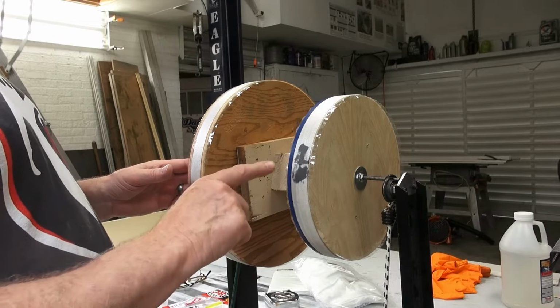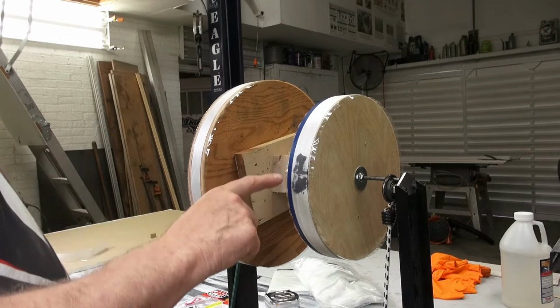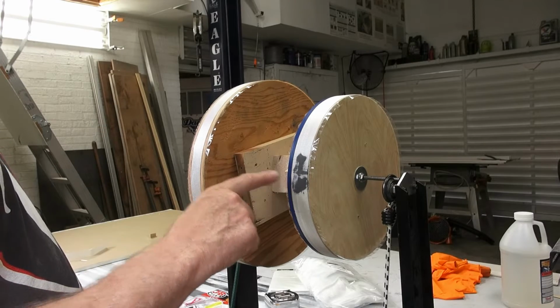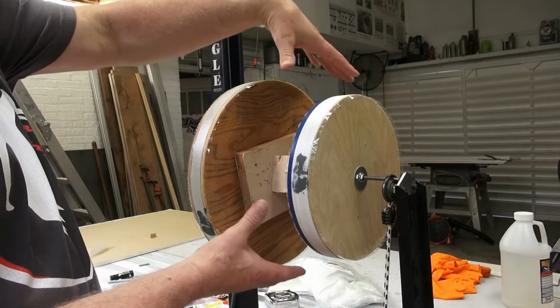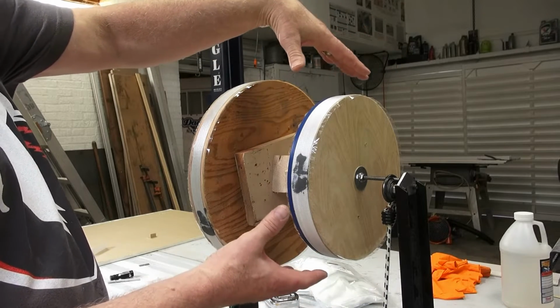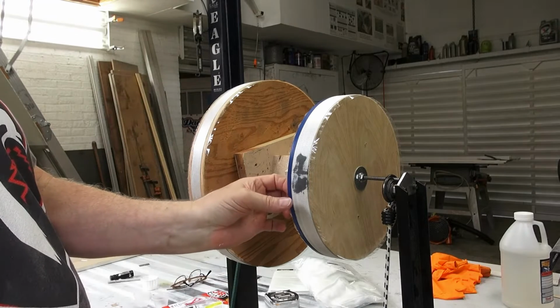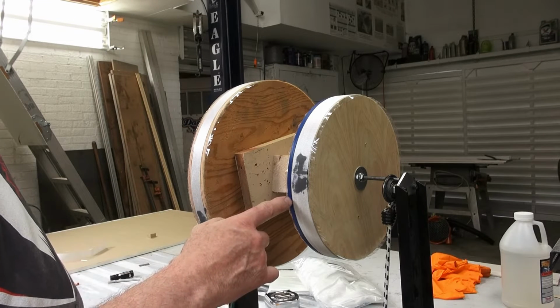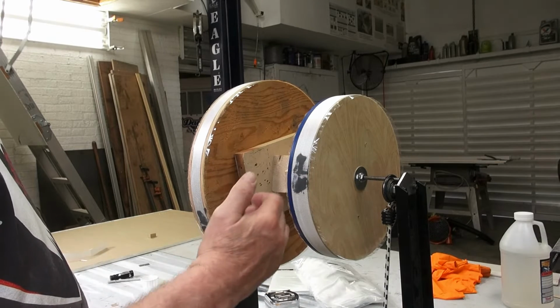and that's going to keep the epoxy from sticking to the mold. And then on this side here, this blue line here, this is several layers of vinyl tape that I've used to build up this edge, because this part of the tube is going to be required to slide up and down to adjust. And so I don't want anything on the back side, on this side of this edge here, to stop it from sliding for the tube to come inside.